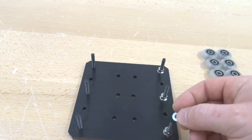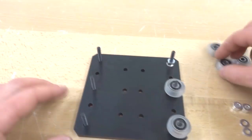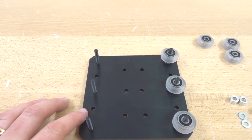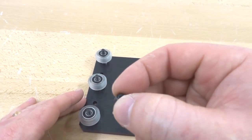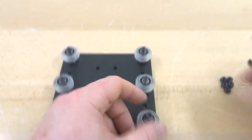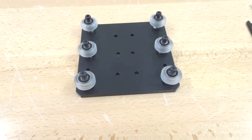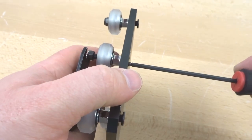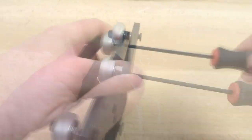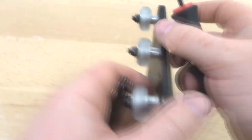After the precision shims, add the wheel. On the fixed wheel side, start with 6mm aluminum spacers followed by precision shims and the assembled wheels. Thread the black nylon hex nuts into place. Tilt to the side, grab the spanner wrench and ball driver, and fasten everything down. Adjust the eccentrics so the marked end faces outward.